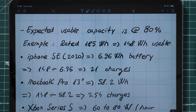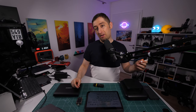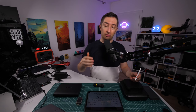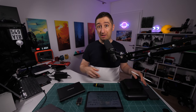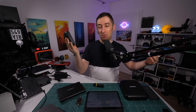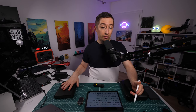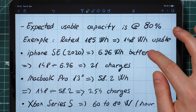When you start using this battery, you can expect about 80% of the total capacity to be usable. There is a conversion loss — for example, the battery needs to raise voltage to 5 volts to charge your smartphone, or to 12 volts for quick charge. Also, most manufacturers block around 10% of the battery to preserve battery life and warranty. So for a 185 watt-hour power bank, you'd have roughly 148 watt-hours usable.